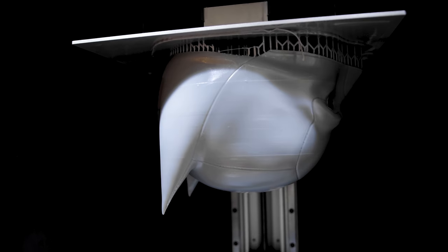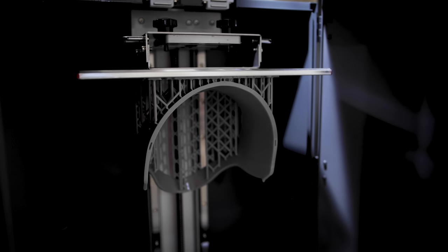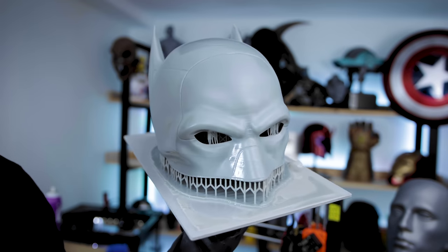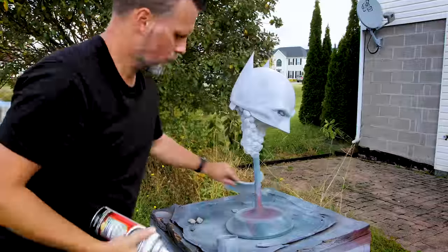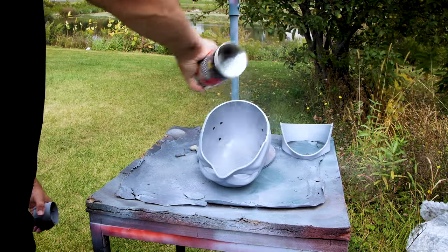Because I did all those test fittings, it fits really nicely on my head. There was no way I wasn't going to print one of these on one of my big resin 3D printers as you saw in the beginning of the video. The quality here has some layer line issues — that has to do with me refilling the resin in my vat and not doing it slowly enough, which caused some ripple effects. But it's really simple and straightforward to sand down compared to PLA or PETG prints, so this should clean up nicely. The reason I did it in resin was because I was half considering making a mold and casting it in urethane or something along those lines.